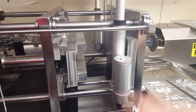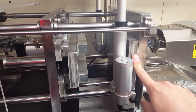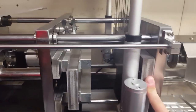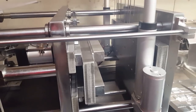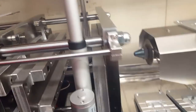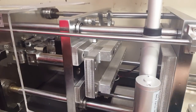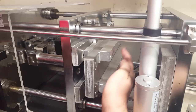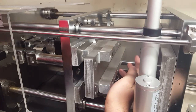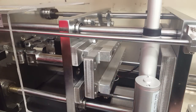And this side, this is also steel. I took this out of the mold. And then on my mill, I machined holes that were very specific widths apart. And those holes match the same holes that are on this side. And what these are for is so I can do molds in, I think, 4 different widths. So I can do a 4-inch, 6, 8, or 12-inch long mold.